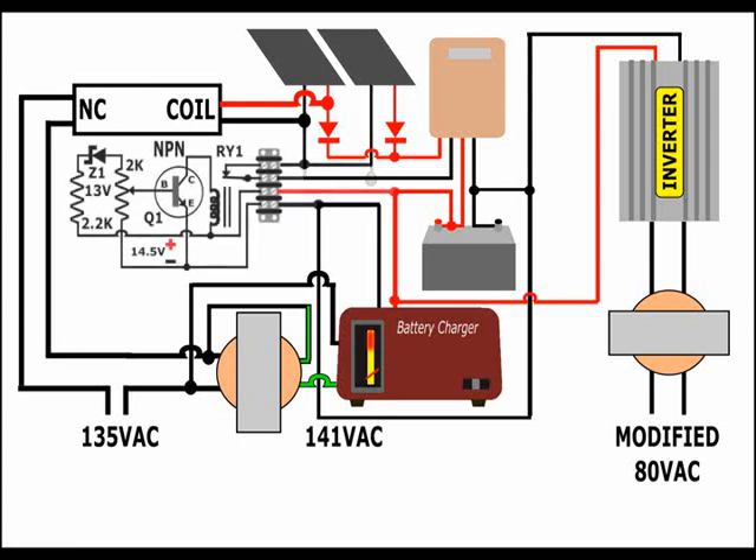With all this, the major improvement I made was building and installing a small gadget which, in the event battery voltage reaches a value greater than 15 volts, disconnects the input of all the panels from the charge controller for a split second, thus returning voltage to normal.